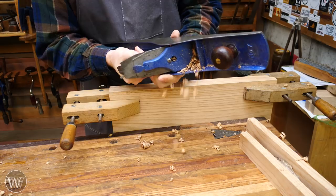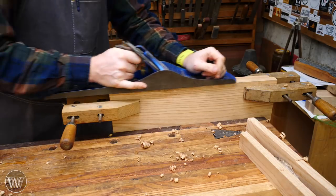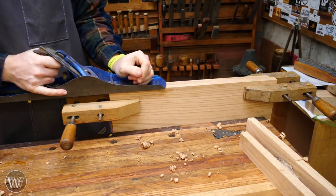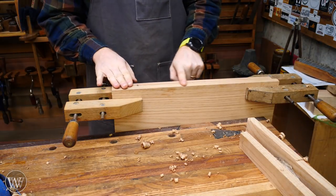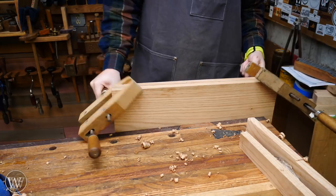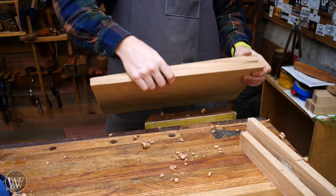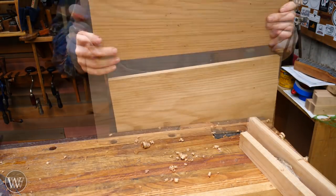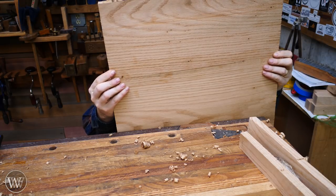That's a really nice edge from side to side. Now I want to back off the iron and take a very, very light shaving. Drop it down just a little bit — now I've got a really nice clean edge from end to end. So when I take these off, theoretically these two should join up perfectly. Very rarely do things in theory align with actuality, but in this case — now I put them together — that's the joint I'm looking for. I don't see any light coming through all the way along that. Very, very happy with that.